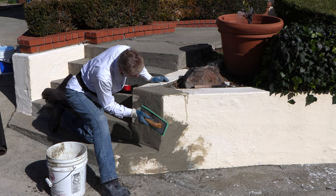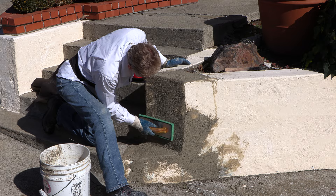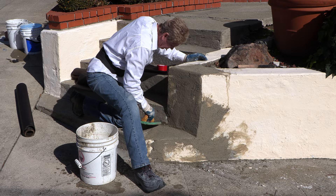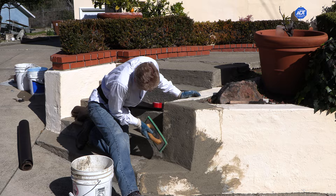I'm just feathering stuff in. Looking at what they have — they have a sand finish that's been painted, and this house is over a hundred years old, so what they've got here is kind of typical. With that much rain, or movement and vibration — vibration is like kryptonite to stucco and concrete, it's not good. Boom boom boom, we're going to clean this up. That's all there is to it, and it does look a lot better than it did.